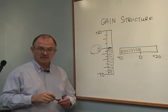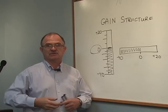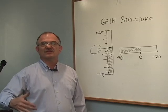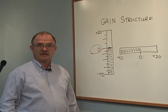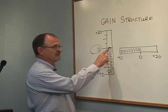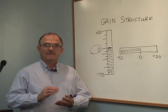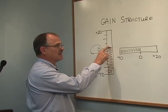One is by simply using an acoustical noise generator of some type, something that makes a steady volume of sound, like a pink noise or a tone, and you set it up so it's about 65 decibels at 3 feet. And you set it 3 feet away from your microphones or 4 feet, whatever the operational distance happens to be, and get a signal into the microphone. And then there's the other way. Take the new guy you just hired and have him sit at the microphone and read from a newspaper until you get his voice bouncing the meter right here. If it's a CD player or if it's another type of multimedia source, set up a signal into that. Bring your favorite CD and play it into the system until you get 0 dB.